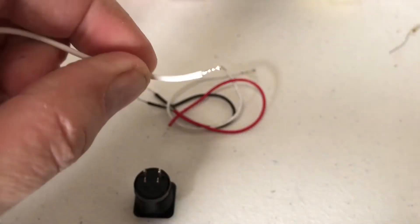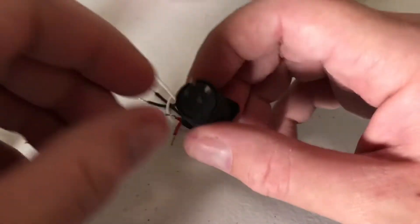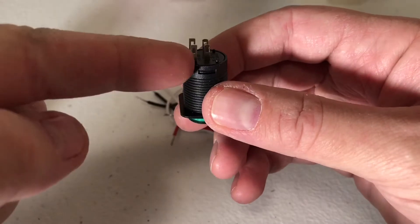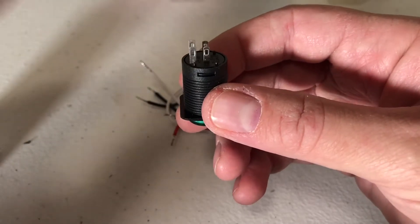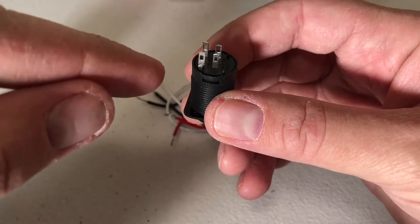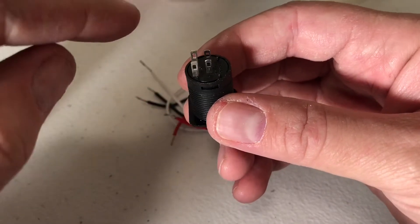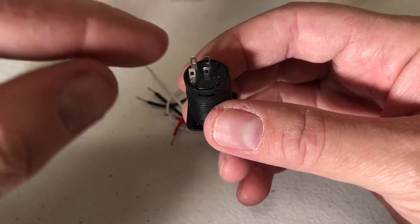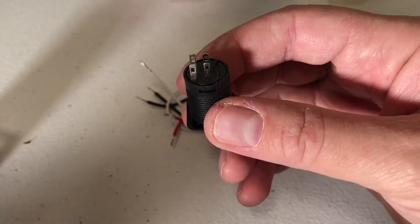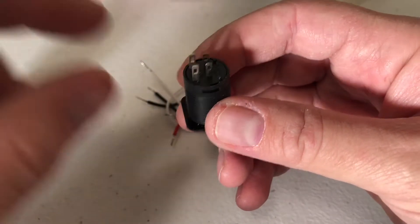All of our wires are tinned. What I find the easiest way to put these wires in is to pre-solder these joints here, shove the wires through, and let it cool off — you don't need three hands that way. So I'm going to heat up each one of these connectors, add some solder into these holes, then heat up the tab until the solder liquefies, shove the wire through, and let it cool down. Let me solder the connectors first and then we'll move on.